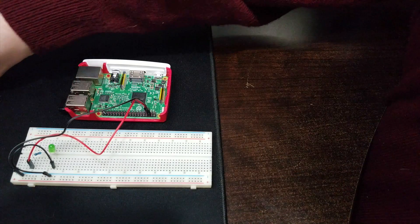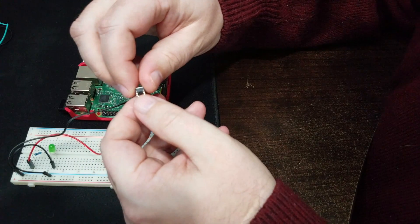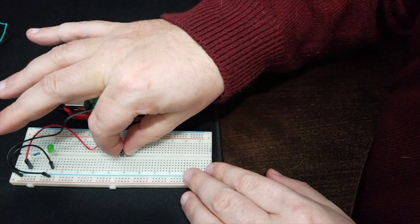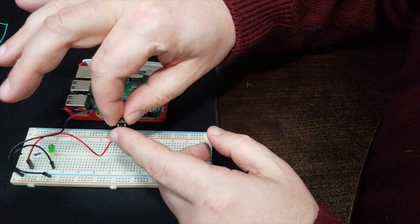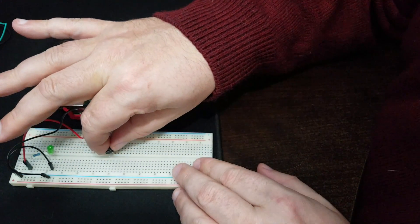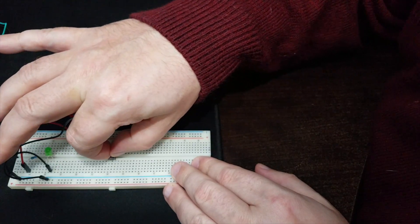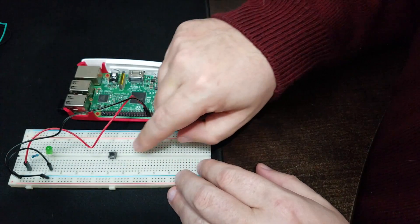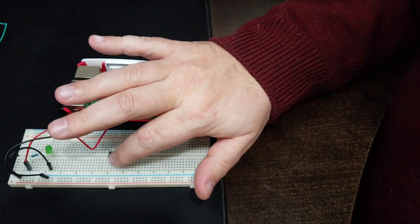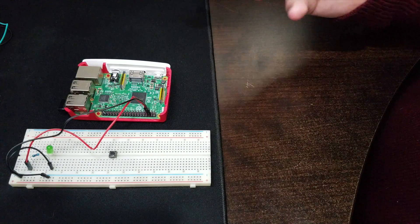With the power gone from the Pi, I'll take my button and look at it — notice there are two pins on each side. You want to make sure when adding it to your breadboard that the pins are oriented side to side, not up and down. I'm going to put mine in at rows 30 and 32, across the gap. All we need is to access the pins on one side — we'll have a signal going through one and ground on the other.